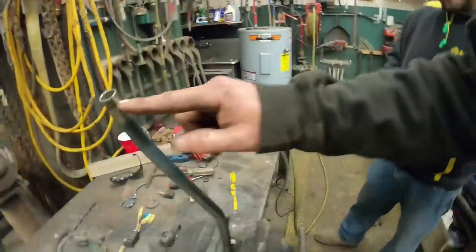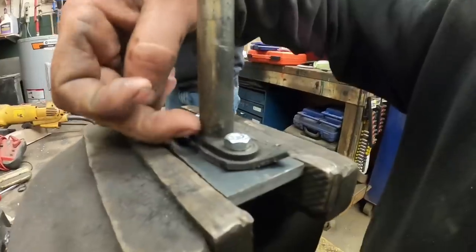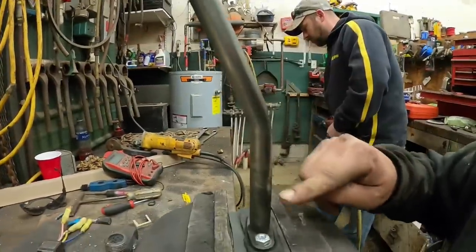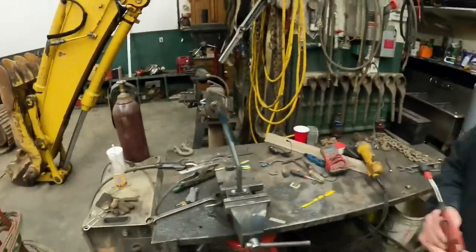This is where we're at. I got the turbo feed or drain tube out of there, and we're just not 100% certain if there's a crack right there. We think there may be a crack. Since this thing's such a booger to get out of there, we filled this tube with water and we got a block off plate down here. Aaron's going to put some pressure on it and see if that water comes out anywhere.